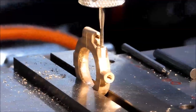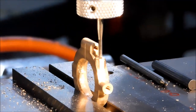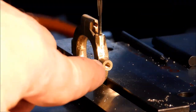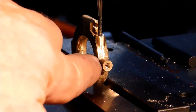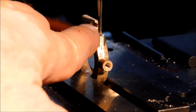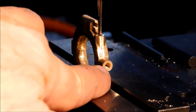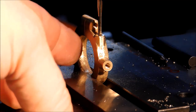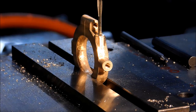When I drilled the tap hole for this particular 256 thread going in there, I set my drill to the depth of the 540 cross hole that drives the valve rod. The valve rod is only going to be superficially into this, and if this tapped drill hole goes all the way through to the center, this 540 pilot drill hole can be used as the bleeder for the journal. So if it doesn't break through the bore, at the very least, make sure it breaks through this hole here.